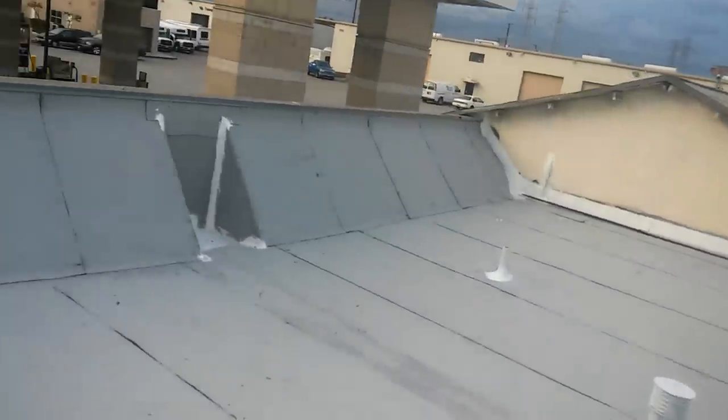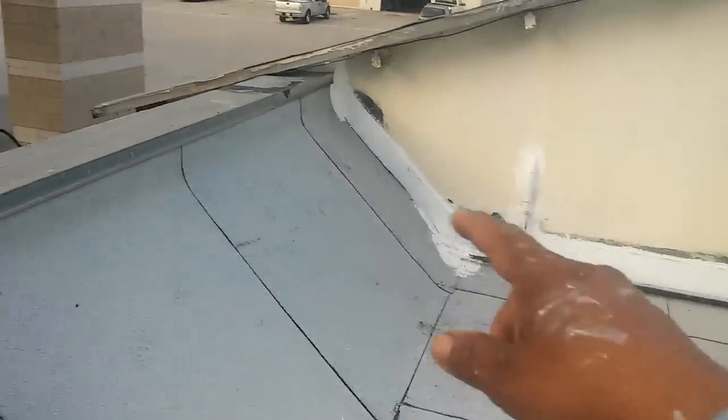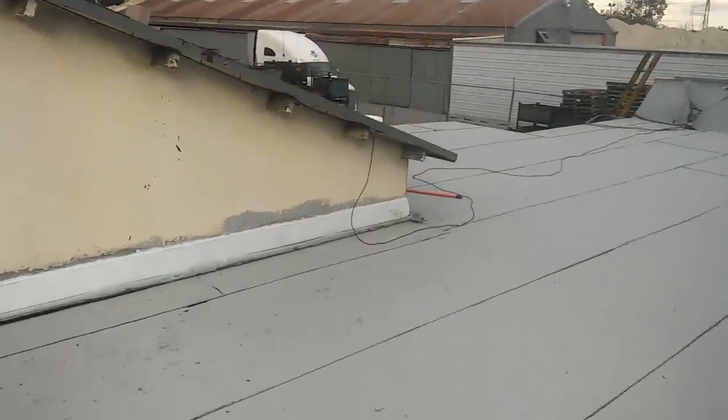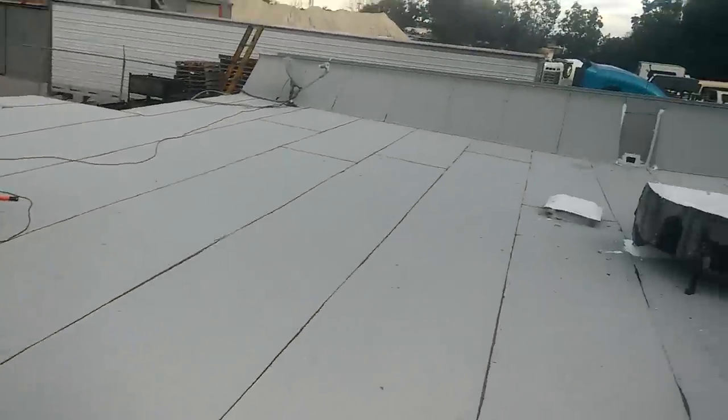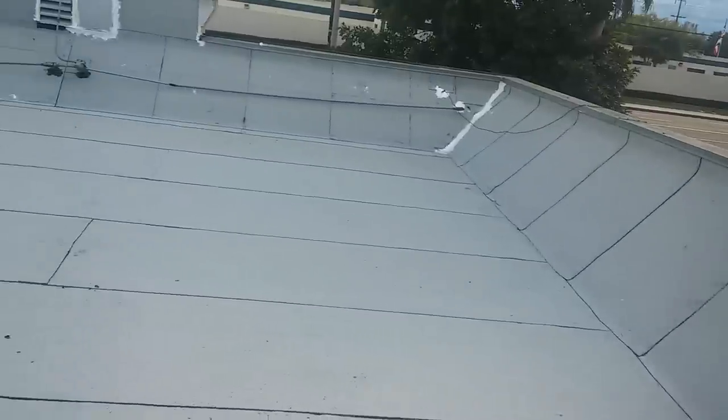Hopefully you like my video. This is how I did my roof — I overlapped about eight inches on the wall, then I came down with the piece of torch all the way to the wall, and then I cut the wall to install the counter flashing. So I'm done. This other little flat roof is a little different, but basically the same concept. It's a wall section, so you do it by pieces — it's better to run it that way.